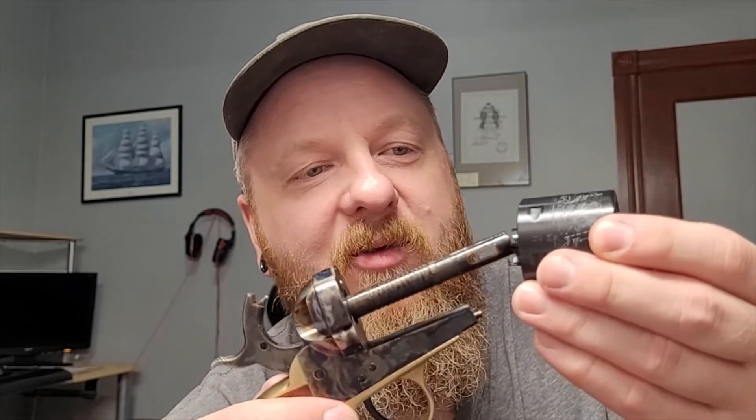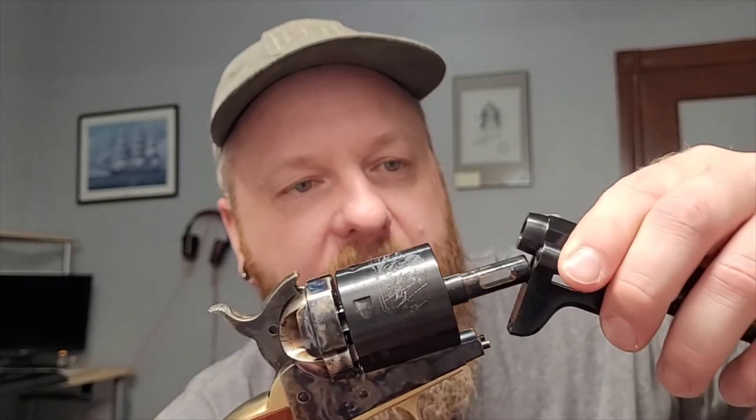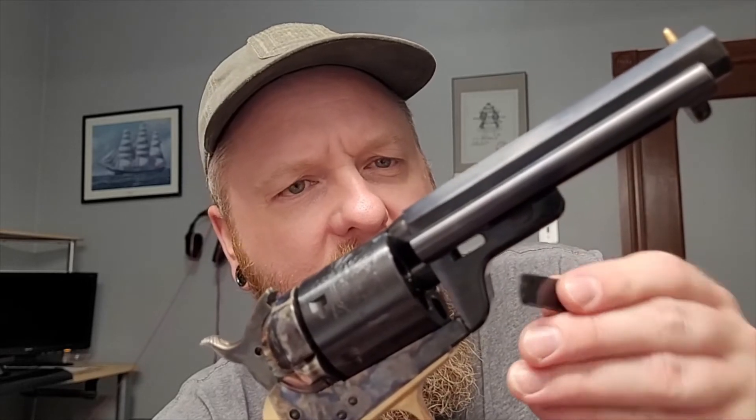There are a few reasons you don't want it that sharp: you'll simply cut yourself, and if fouling gets built up on the bottom, when the cylinder rotates it's going to cut and score the cylinder — any kind of metal-on-metal contact, you're going to get lots of scoring. Also inside, there's more metal work I've got to do. Inside the hammer channel there's a lot of scoring — I'm going to have to take my Dremel and polish the living crap out of that and disassemble the hammer side and polish that as well. I can feel it rubbing on there.